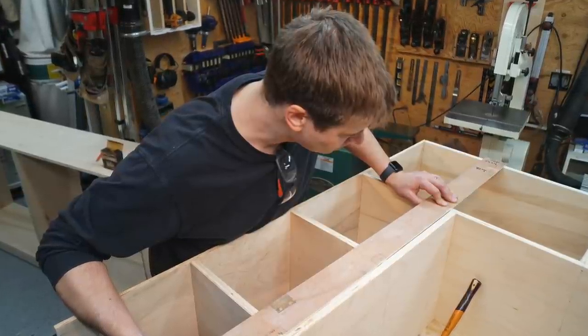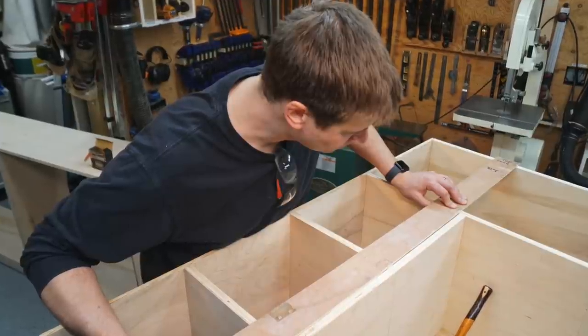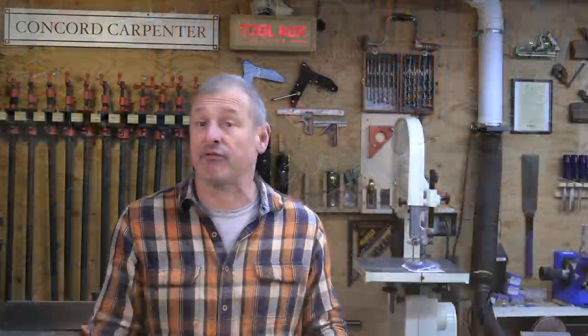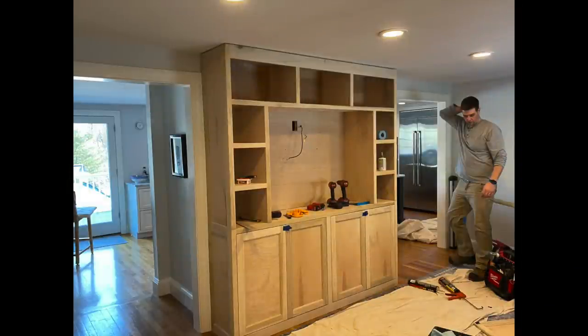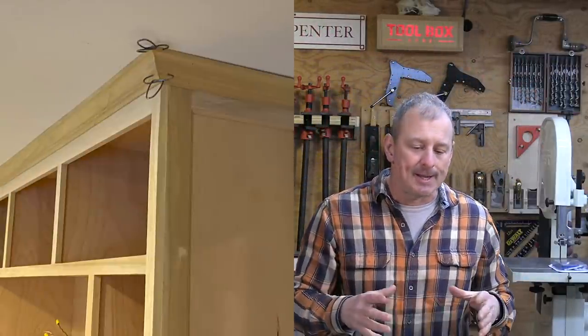On the story pole face I draw everything including the gaps between the doors, face frames, even the three-quarter framing on the boxes and the cabinet box panels. For this particular project we chose birch plywood to build our cabinet, as well as shelf frames. The doors used three-eighths birch plywood, and then poplar wood on the frames, shelf nosing, and door stiles and rails. To cap it off, we got poplar molding for the top of the bookcase.